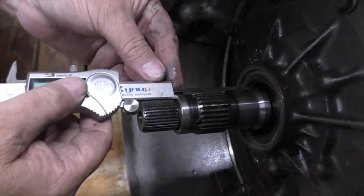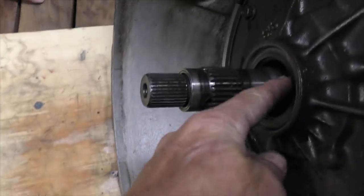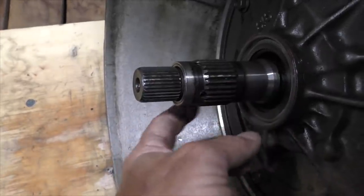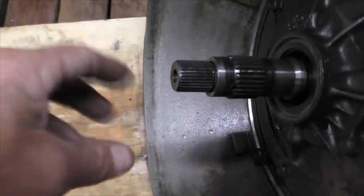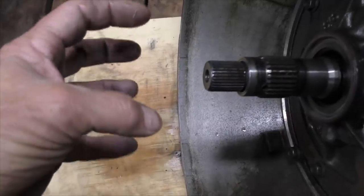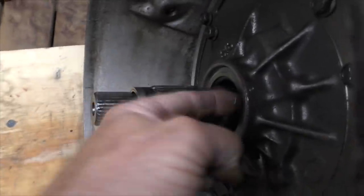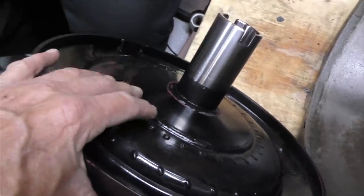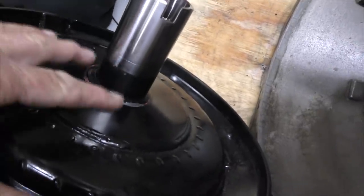All the way down, and then from here back into where the pump engages — that's spot on. The little notches here go through that oil seal and grab onto little tongues that stick out on both sides — that's what turns this oil pump. Then oil shoots down this thing and out this end, which used to feed the torque converter. But what the eliminator does is it sends oil back through the outside here and back into the pump, circulating through the rest of the gears too. Essentially it's just a smaller converter with no slip at all — just shorter, with a lengthened shaft. It's about the same weight.